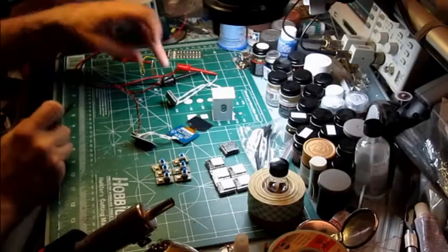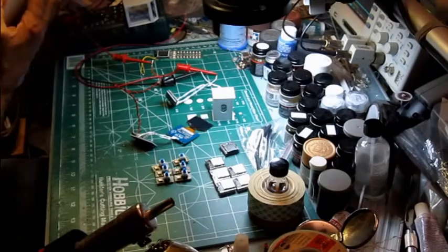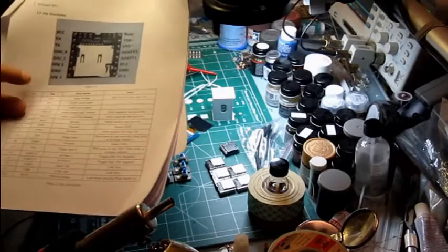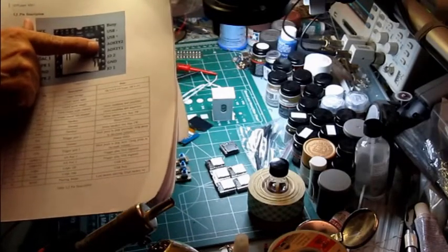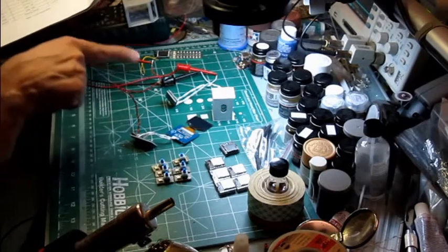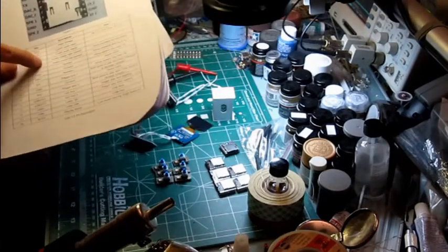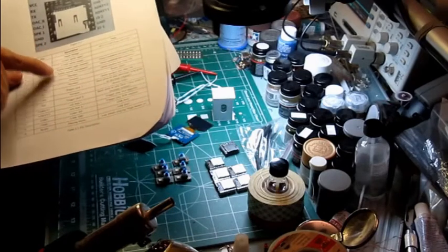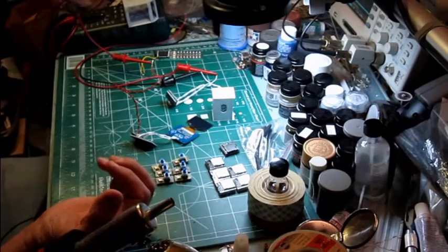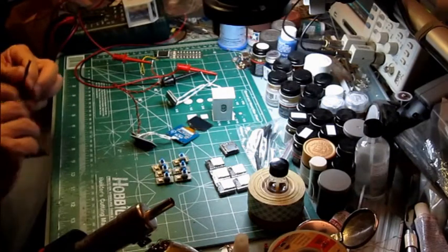Okay, what's nice about these? I don't know if you can see the picture here. They're under $2 a pop, and you have all your pinouts. All I was doing was taking advantage of these AD keys for all of my tracks that I want to access with the sound effects. You have 2 speaker hookups. It's rated at 3 watts, and it's pretty loud. Then you have your VCC and ground. Couldn't be easier to use this guy. And I believe it also will do WAV files in addition to MP3s.